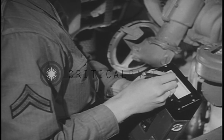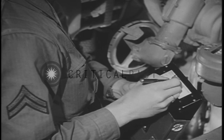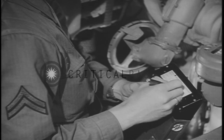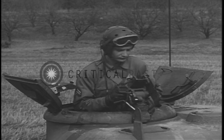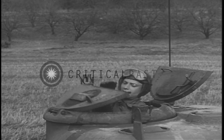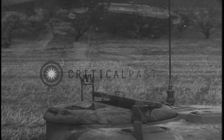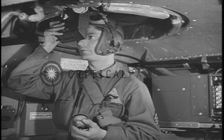You'll have to adjust your four periscopic sight heads separately and keep a record of each. Sight adjust all the heads when you have plenty of time, and recheck at least the one in your sight just before firing. When you fight buttoned up, the tank commander dismounts the anti-aircraft gun and stows it in the turret. And now we're ready for action, with our tank tight as a drum, the sight and 75 in alignment, and all preparatory steps completed. Let's see some action.